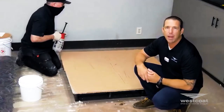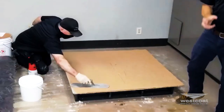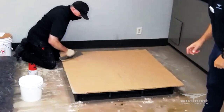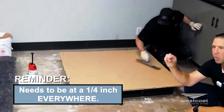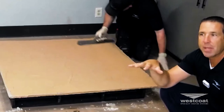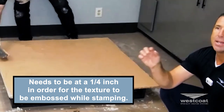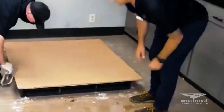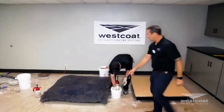What Mike's doing right now is spraying a little water on the surface. Remember, this is a dry polymer cement and it can be sticky. We don't need a perfect finish on this surface — we need the product to be one quarter of an inch consistently, on the edges, on the edges of the joints, so that when we stamp this and stand on it, the texture is able to create that embossment. If you have a breeze coming in from one direction, you'd want to take a skin and go over that edge to give it texture.